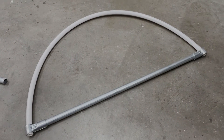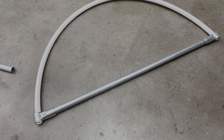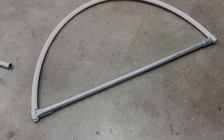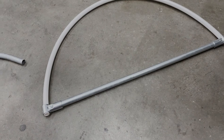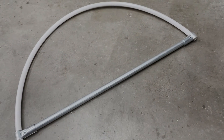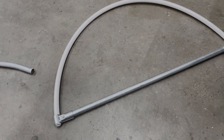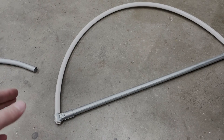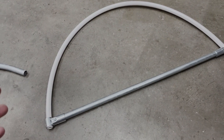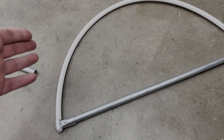You do have to add something to add rigidity for the actual arch or half-circle. The way I've done it here, and the way Harold did it, was just by adding that cross pipe. But you could also incorporate this into a full build — maybe you have a cube structure and you want to add a T connector off of the cube and then just have a PVC arch that goes from one side to the other. Also, to calculate the same kind of arch, you can use the calculator from that bend tutorial video to figure out the length you need. I basically got the same measurements from the calculator that I did for those incremental bends, then just cut the PVC to length and bent it over.